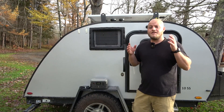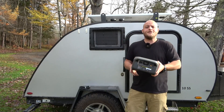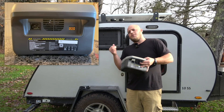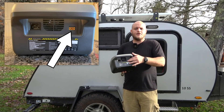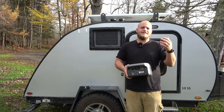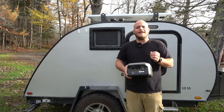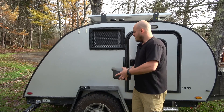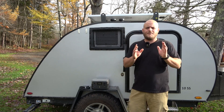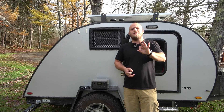To wrap up — there is a blazing sale going on for a limited time. For solar charging, it uses an XT60 connector. EcoFlow Delta panels plug right in, and you can easily get adapters: XT60 to MC4, XT60 to Anderson, or 8mm. They cut you off around 30 volts, so this is a parallel connection — you're not going to string panels together on this tiny system.